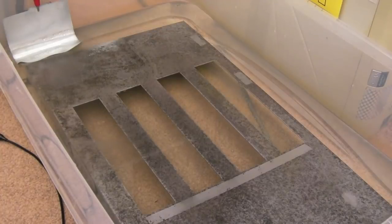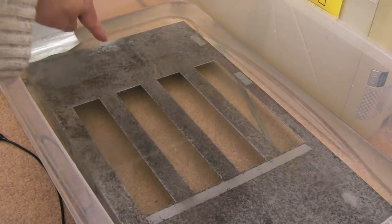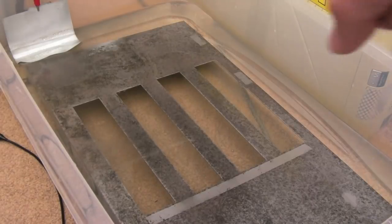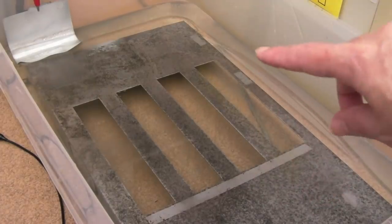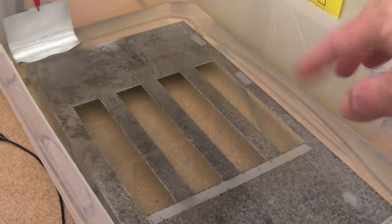So this is the problem, and you can sort of see, can you see down here where it started to plate? I had this over there a minute ago and it plated just the top there and the side. So this is not going to plate the whole thing, but I can continuously move this around, shift around, just try and get a distribution there. But as I say, at the moment the metal part itself is not in the direct circuit there, although it's passing some of the current through the water there. It's not got anything clipped onto it.